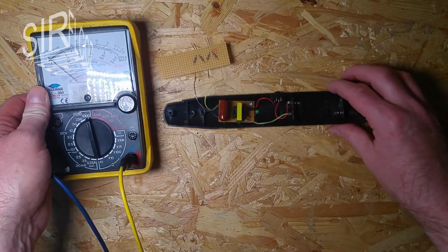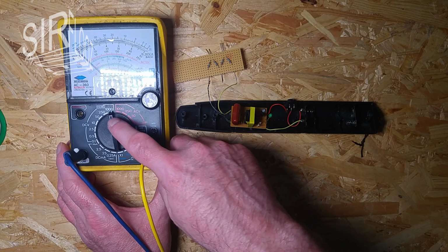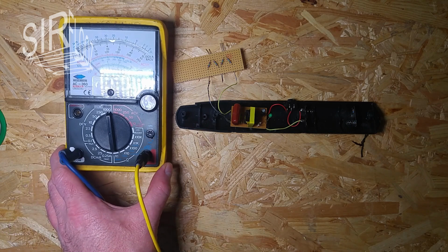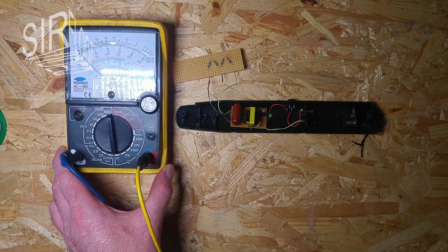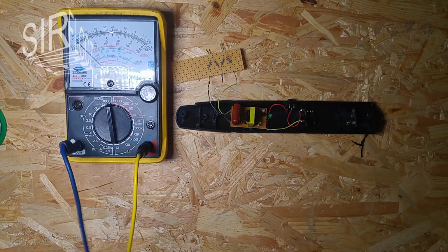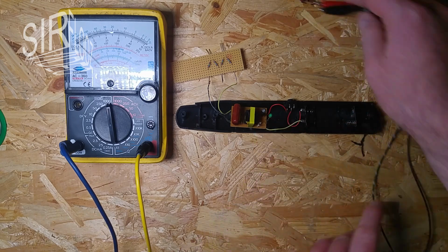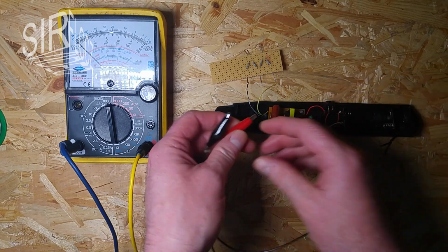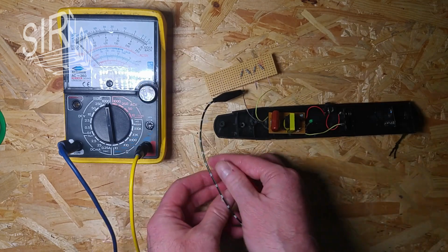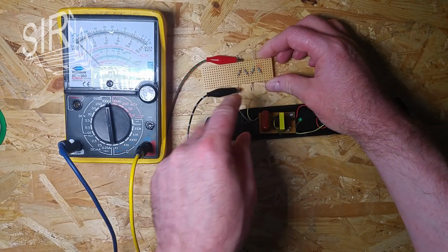And for this, I want to use this measurement device. It's analog, as you see, and has a rating of 1000 volts max here. Just so that you have the reflection here from the light, but I think this way it should work. Then I just have to connect the ground lead to the ground and the positive lead to the terminal of this resistor here.